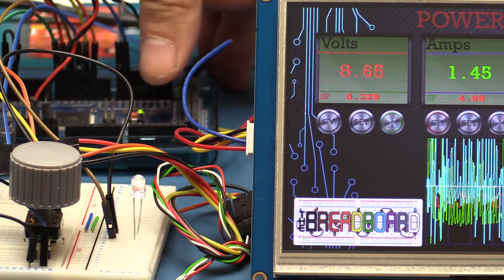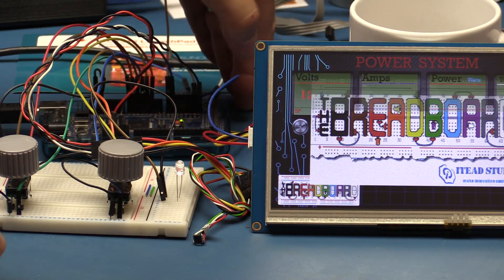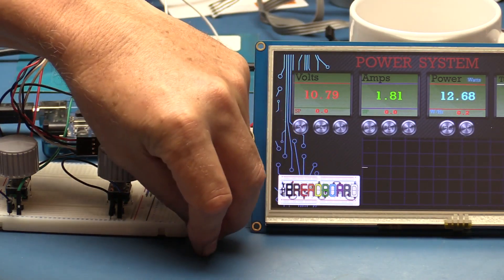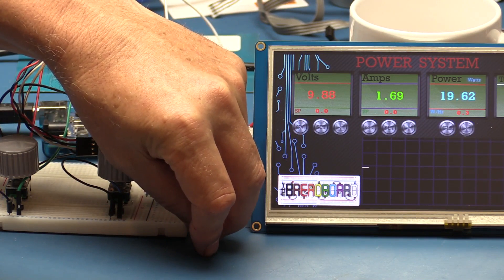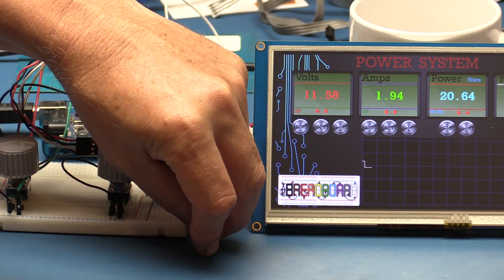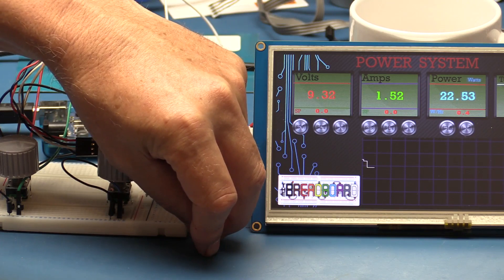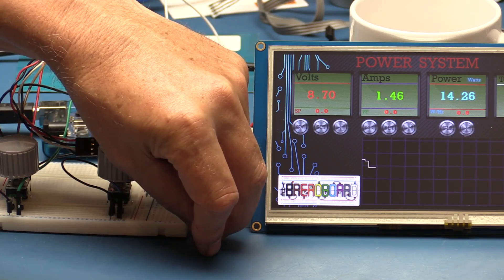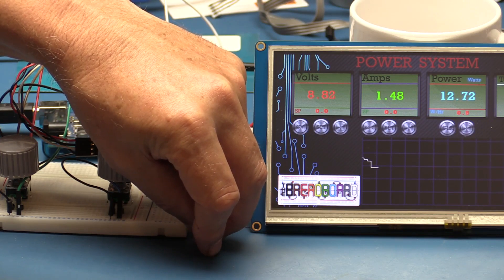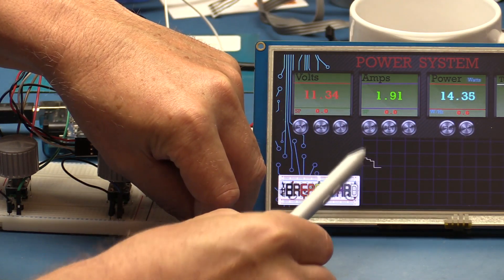Let me reset the Arduino Mega. It comes up with a nice splash screen for the breadboard, and the default condition has all tracing off. If I put my finger on the temperature probe it'll take about 10 seconds before it gets a new reading. I have parameters to adjust how often it reads sensors and updates displays — the update is set to 10 seconds but it's reading every second. You could add averaging algorithms in there too.